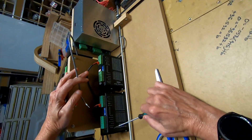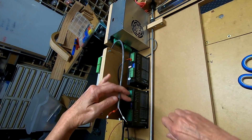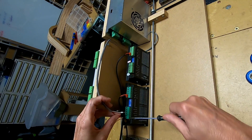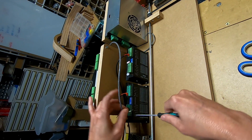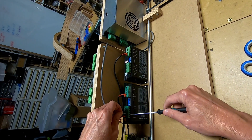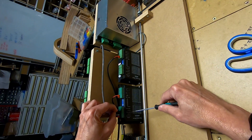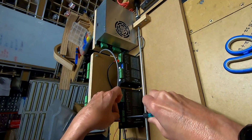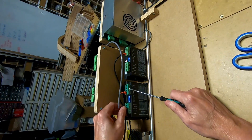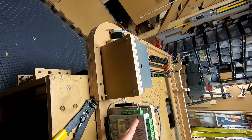Over on the driver side, you'll see there is a pulse positive, a pulse negative, a direction positive, and a direction negative. We're going to connect the red to both the pulse positive and the direction positive. Connect the pulse negative first, then the red to the direction positive, and the black to the direction negative. The X-axis driver has now been connected to the laser controller X-axis signal output.